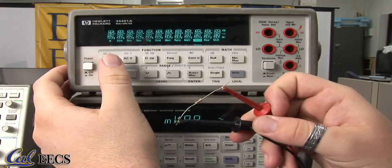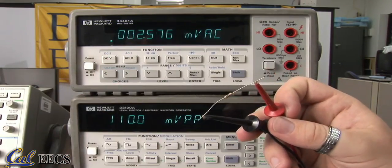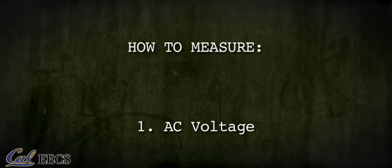The multimeter is your friend. It is a powerful tool for debugging your circuits. It allows you to readily and accurately measure voltage, current, and resistance to check the performance of your circuit against your calculations. You can measure either DC voltage or the RMS value of AC voltage. You won't be expected to know what AC voltage is at this point in the class, but later on you may want to use this function, so I'll go over it quickly.